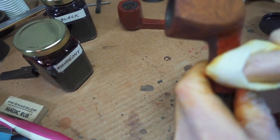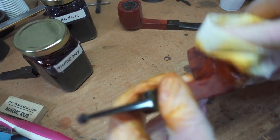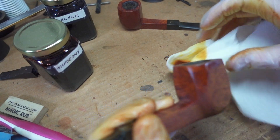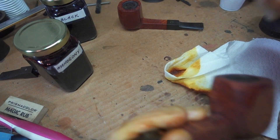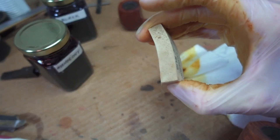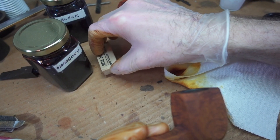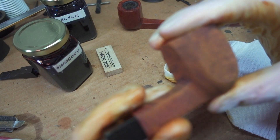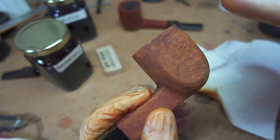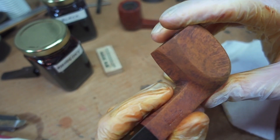After this step you can inspect your sanding. All I used for sanding on this was either my finger or some paper wrapped around a medium soft eraser. I only sanded up to 400 grit — if you use anything finer than that, you'll end up polishing the wood and the stain won't soak in very well.